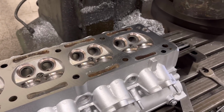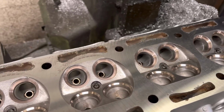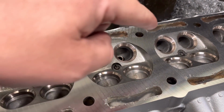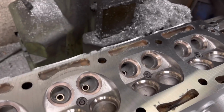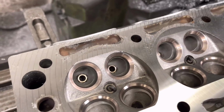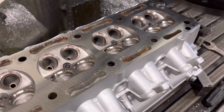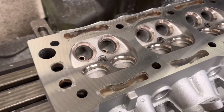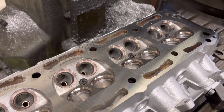So we've given the Cosy head a 3 thou lick over, and as you can see on the back edge, especially over here, you can see where it's been blowing very slightly. So although this one's pretty good for corrosion, it does need another lick over. We'll just give it another 3 thou, and all should be good with that. Fingers crossed.